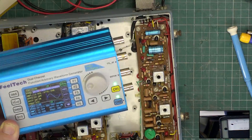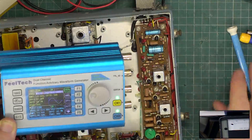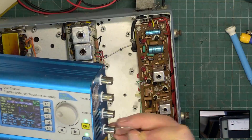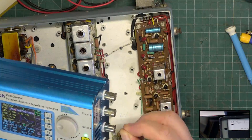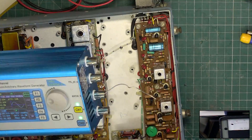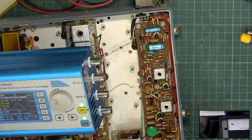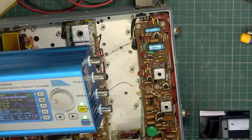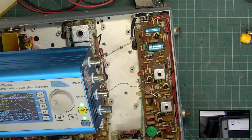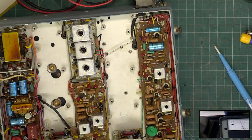Now I'm going to turn the volume up so you can hear the musical note. I've not even got anything plugged in but I can hear it. I've poked a bit of solder in the output. Now we adjust the trimmer for null. That's it - now it's on frequency. If I go the other way, we'll get a musical note again. Back. Okay, we can switch this back off again. Switch the tone on the signal generator back on. We know it's spot on frequency.